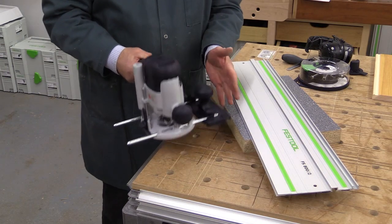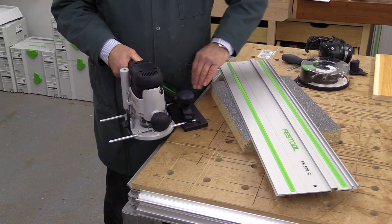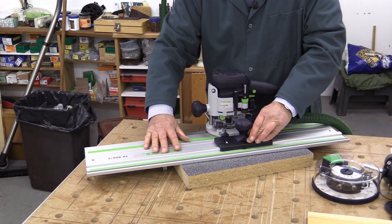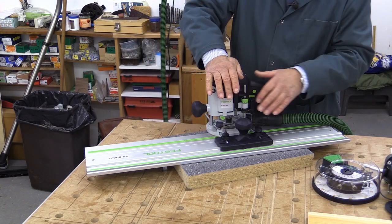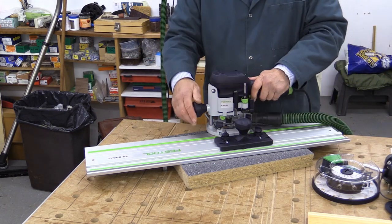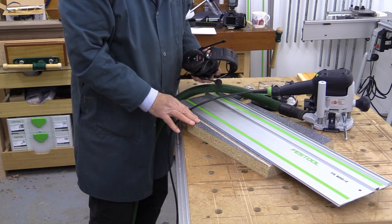In order to demonstrate the guide rail attachment, I've fitted it to the router using the guide rods from the side fence. Supposing you wanted to go at an angle across the surface of a piece of material — you can't use the side fence, so the rail is the ideal tool to use. I'm going to install this on the rail, loosen off the locking knob, then push down until the cutter is touching the surface of the wood, zero this, go up 3 millimeters, lock that off, and there you can see the cut at the angle across that piece of wood.